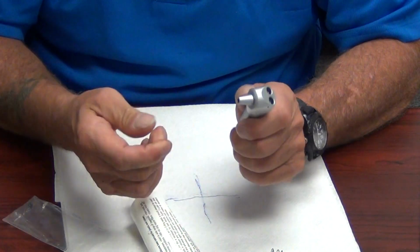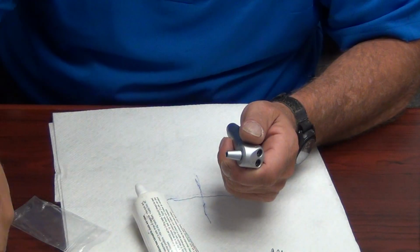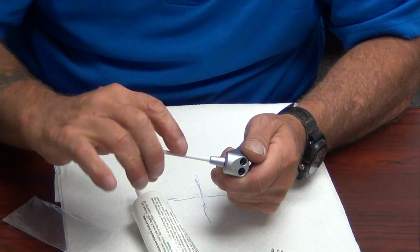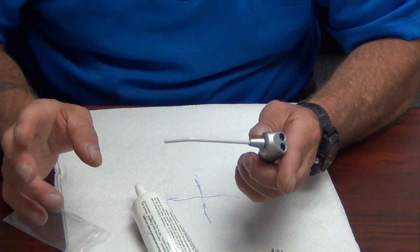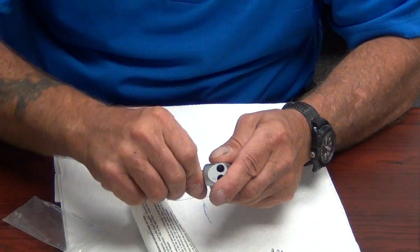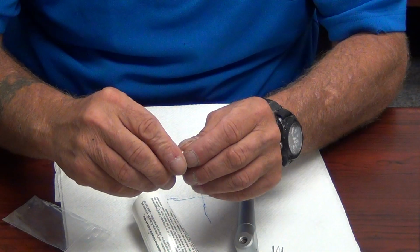Let me take a moment to go briefly over another type of tip holder that you'll see predominantly on a Parts Warehouse syringe or a Beaver State syringe. It's a push tip holder like this. They're very easily serviced using the same syringe tool and the same O-ring. Unscrew the tip holder. It comes in 2 parts.